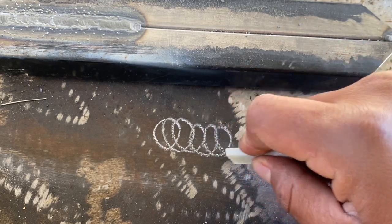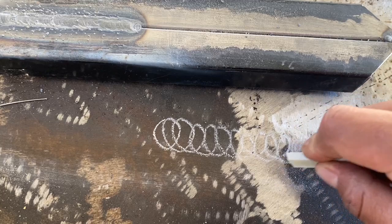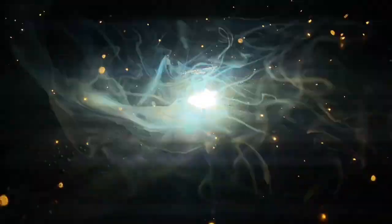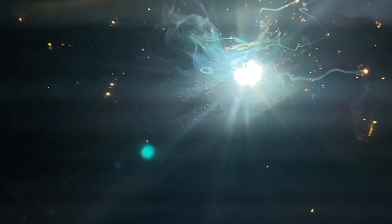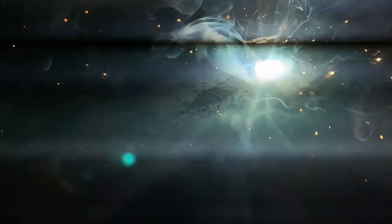Next we have circles. Always want to eat half of your previous weld — half of your previous circle. This circles technique is by far my favorite with this machine, these settings, this wire, and this process — gasless flux core welding thin square tubing. Keep the circles nice and tight, make sure you have full control of the puddle, ensure fusion on both sides, touch both sides in a circular motion, and always eat half of the previous circle.